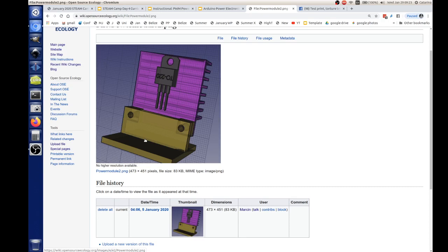The limit is really how much those leads are going to transfer. And probably in practice, for the most, it'll be like 30. Let's say 30. But what's their maximum voltage? Just for the background on this, the IGBTs, we selected the ones that are 600 volts.